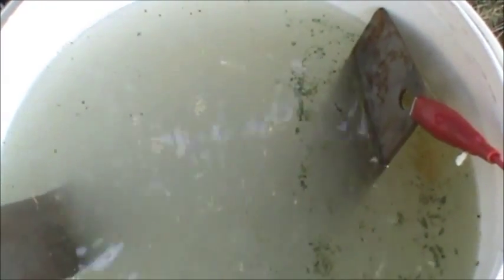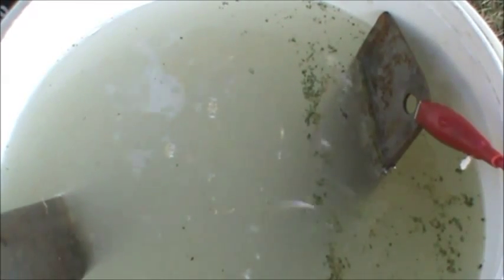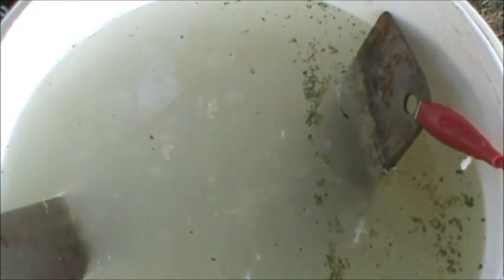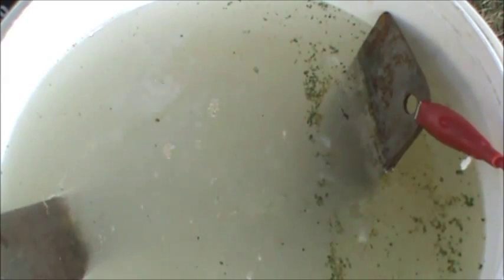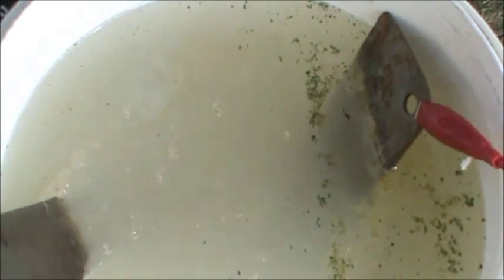You do need a good electrical connection. If the tool is totally covered in rust, you may have to use a wire wheel, wire brush, or sandpaper to scrape a clean spot to clamp onto. Also keep in mind that if your wire dips down into the bucket it'll probably dissolve. This really isn't a dangerous process — it's just water and washing soda. Disposal is probably fine — you can likely just pour it onto your driveway and it'll dry up.